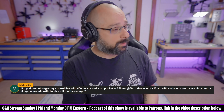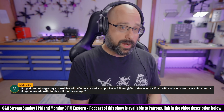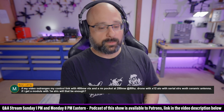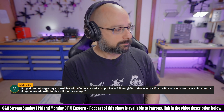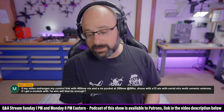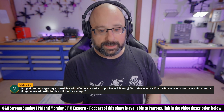So if you were to go to a module with 1W ELRS power, you would approximately double your range. And you can decide if that's enough — you're the one flying the drone. I can also tell you that that ceramic antenna is costing you about 6dB, so that's another doubling of the range if you had an external antenna instead of that ceramic antenna.